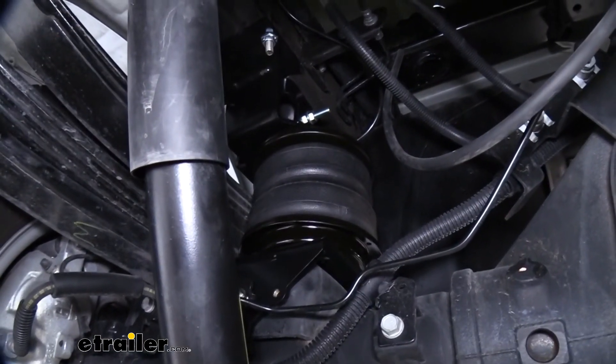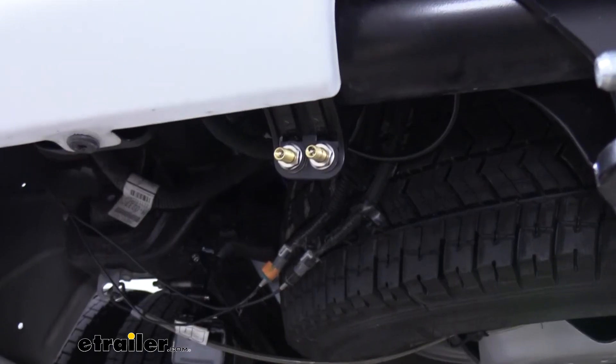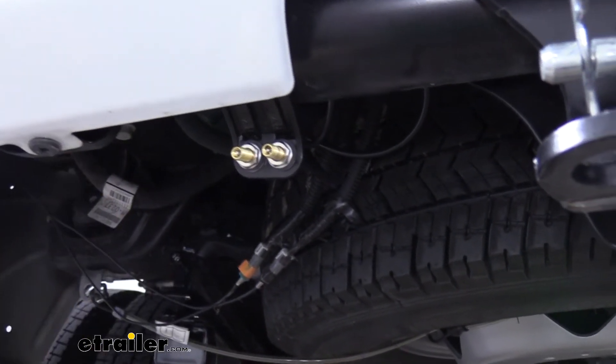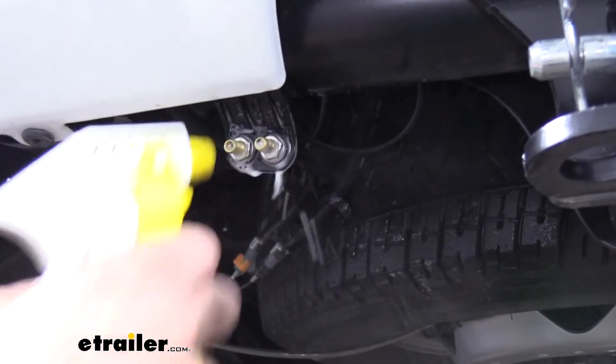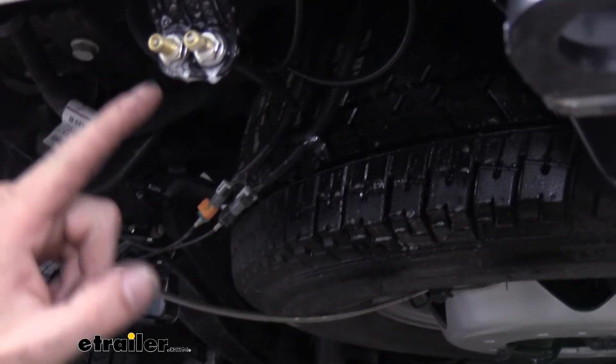A little bit of air goes a long way, so you don't need to hold it on there very long. To check for leaks, we've just put some soapy water in a spray bottle here. And we're going to spray all of our connection points — we're looking for the presence of bubbles. And not these bubbles like you see around the edge here — those ones aren't changing.